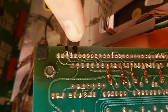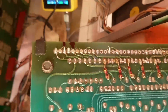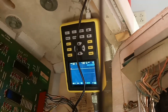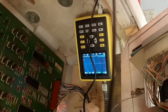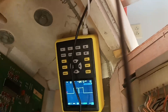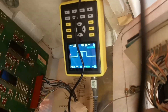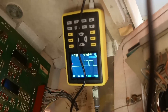The pin in question is this one with the plus sign. I've got a parallel pin — basically another segment — two pins over, also marked with a check mark. I put my probe on the working one first. When it's pulsing on, it's reading a signal of about 4.5 to 5 volts, but this is set on times 10, so that's 50 volts — fairly spiky. Moving over to the questionable one, I see a nice square wave, actually a little bit higher. I believe what's going on is it's got a perfect wave because there's no current and it's just dead-ended. We're getting the signal to the pin — it's just not passing through the glass. So we have an open segment somewhere in the glass, and there's not much we can do about that.